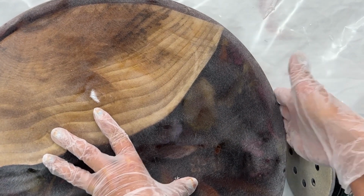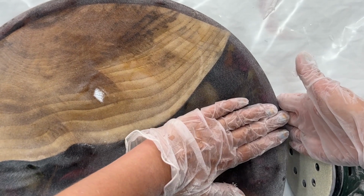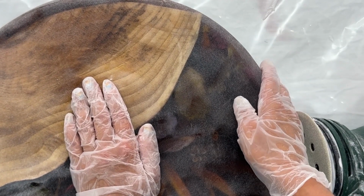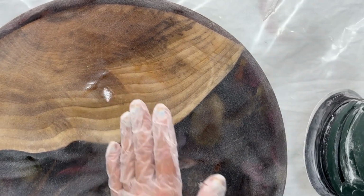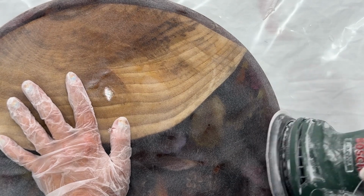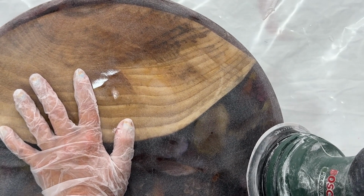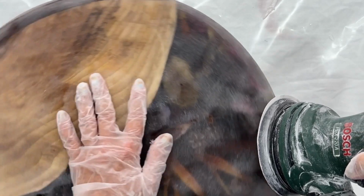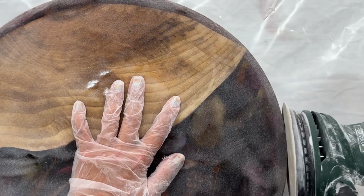But when we are working with the caramel edge, we clean our countertop, making it level, and we polish our edge, it also becomes level. You'll get virtually a 90-degree angle. It's level. We do not require this angle here. So the third step is to clean our machine. After processing the edges, we are now smoothing the edge with our machine.